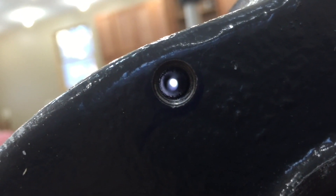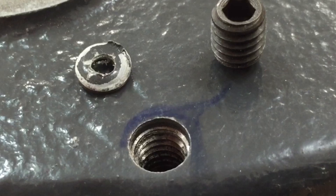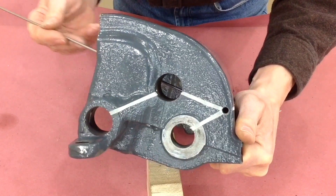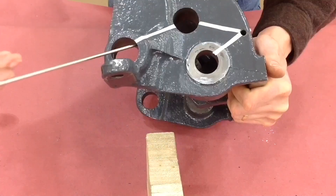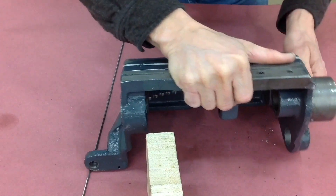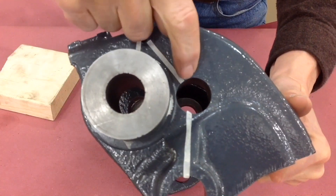Here's another photograph of that hole — it's got two plugs on either end of this gallery. When I removed the plugs I destroyed them, so I tapped the holes and I'm going to replace these plugs with a couple of set screws. On either side of the casting there are additional holes drilled from where the bronze bushings go up and intersect in that oil gallery. The oil will literally just gravity feed down to each of the bronze bearings on either side of this casting.